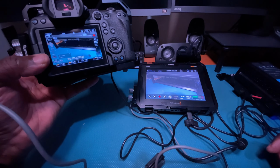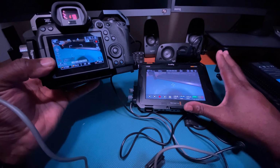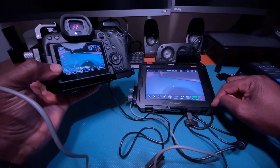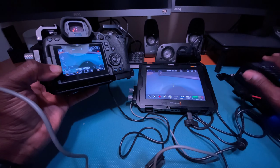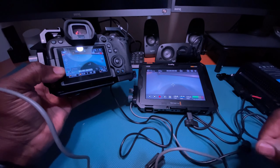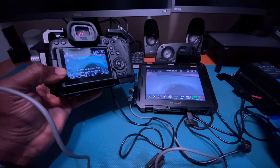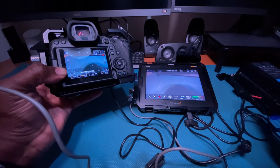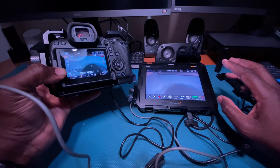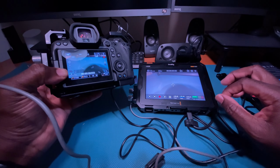What I need to do is give this a really serious test drive and just make sure everything's working reliably. The gain for using such a setup is one power supply for the camera, the external recorder, and if I wanted to also drive an audio recorder, I could drive it all off the V-Lock battery. By replacing the Canon lead adapter with a more open or more standard adapter, I can use the same Canon dummy battery with a lot more devices to power up the camera. Also, by recording externally, I'm working with ProRes 422, which is a lot easier to grade, at least on my computer, than using the H.265 format that the R6 uses for C-Log grading.